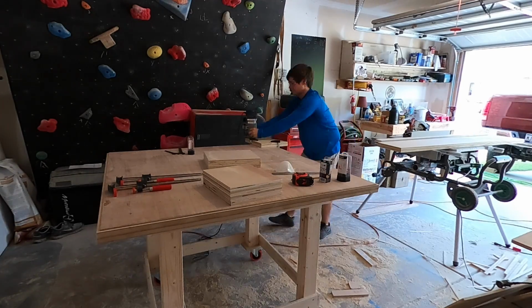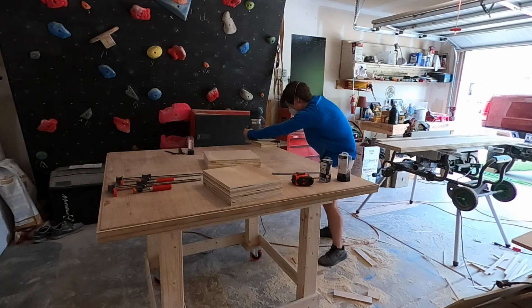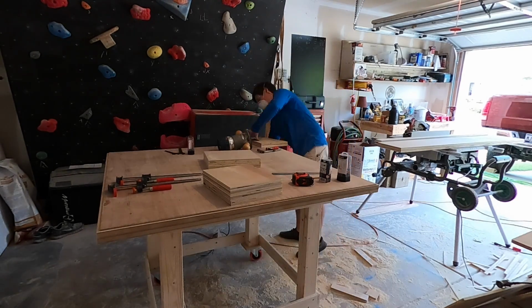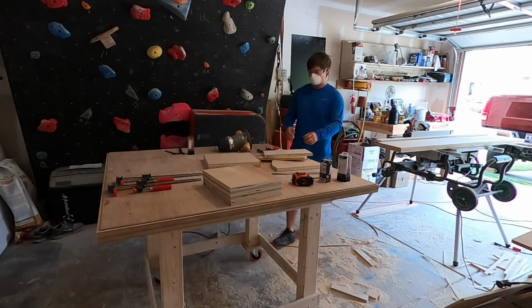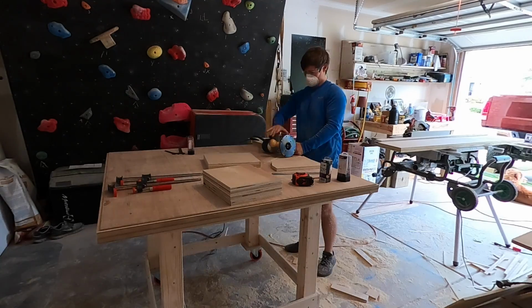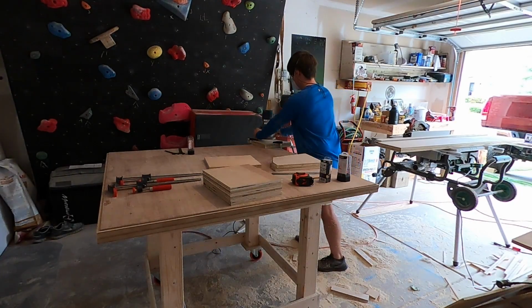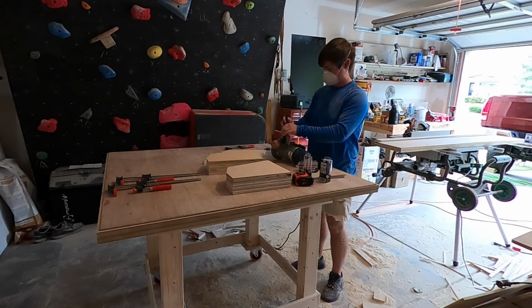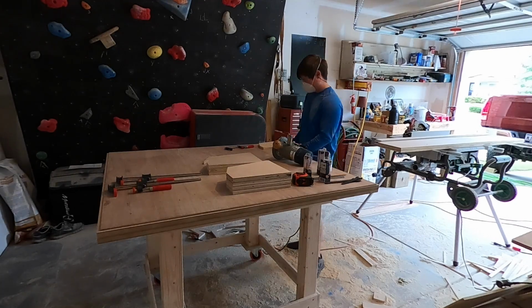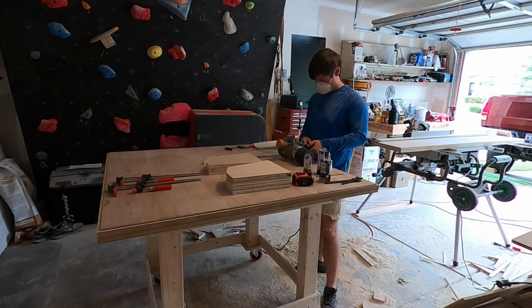Looking back, I probably should have done smaller passes. I was trying to take way too much material out in each pass. One reason is because the top roller bit was very long, and so I had to at least take out a half an inch in the first pass, which on a 1/4 inch shank router bit, which is what I'm running, is way too much material. You probably only want to take out at maximum a 1/4 inch of depth in each pass, so you don't put too much side loading on your router bit and cause it to dull quicker.